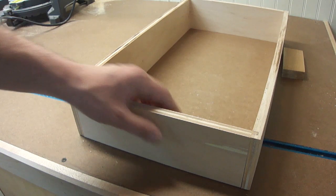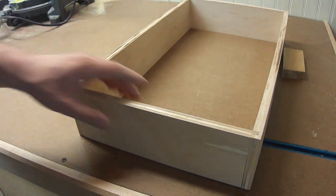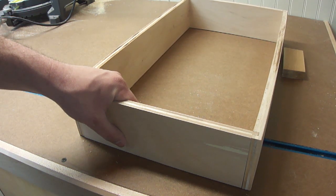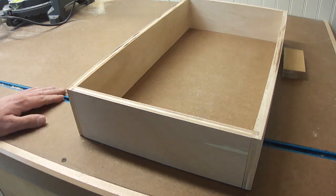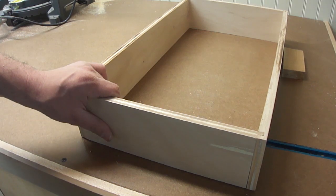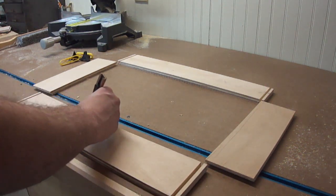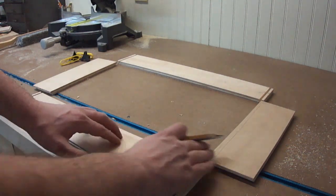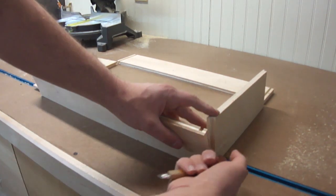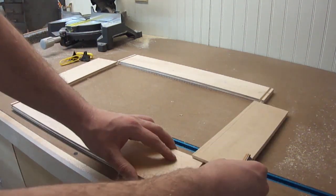However, as you can see, this is a very small drawer — just over 10 inches wide. So it doesn't have a real big span; it's just going to have some drill bits and hole saws in it. So I think for this one a quarter inch bottom will be plenty. I still have the quarter inch dado head set up in the radial arm saw, so we can go ahead and cut a quarter inch groove all the way around for the bottom. One final thing I want to do before I cut the grooves is to actually draw on them where the groove needs to be, to make sure I have it set correctly so I don't end up with the groove on the outside of the front or back.